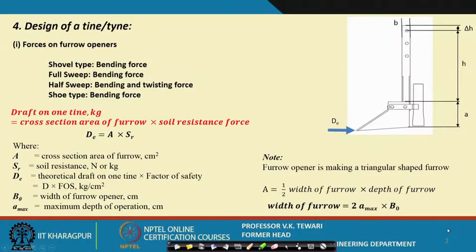What we will talk in this section: there are two things. One, we are talking of the tines or shanks and the shoes connected to them, and then these are connected to the main frame. Depending on the total number of shanks or furrow openers, the size of the frame will also be designed. We will start first with the shank, shoe, or furrow openers. In many books you will find these referred to as tines, though the design here is slightly different from a cultivator tine — it is a shovel type that opens the furrow.